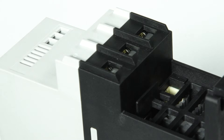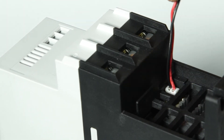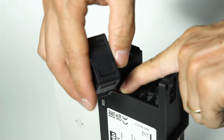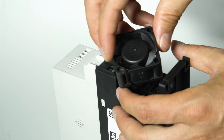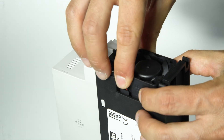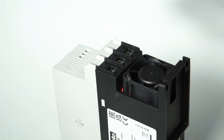For example, on an ADXN size 2, connect the pre-wired supply cable of the fan to the terminal located on the bottom of the soft starter's base. Then thread the cable in the appropriate slider. Finally, insert the fan in the dedicated slot and press slightly down until you hear a click.